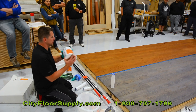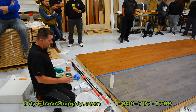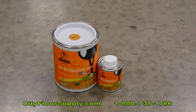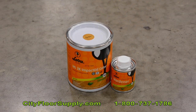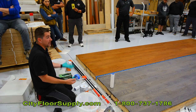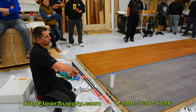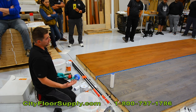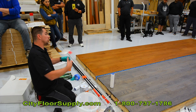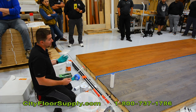Mix it up a little bit and put the can inside. Most of the time I really like to use a bigger quart can or container if I'm doing one or two at a time. When you put all the hardener inside, there's very little head space to put the mixing paddle in and actually mix it up. If I'm batching two together, I put them into a two-gallon mixing container. Try not to go more than a thousand square feet at a time — you're just not going to have enough time to take it off. Pot life is about three hours; let it sit for about 45 minutes, maximum about an hour and a half. Once it goes too far, it's going to start to get sticky and be a headache to remove.